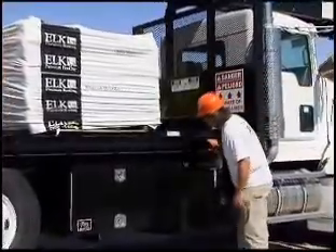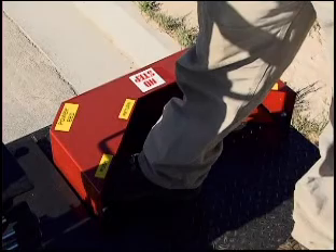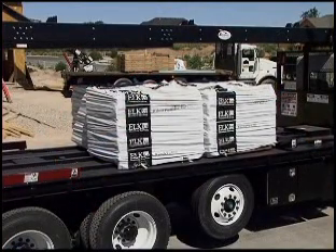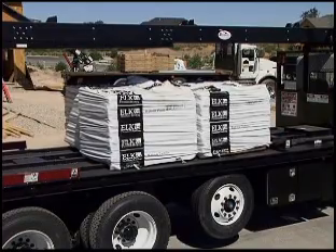Making sure there are no obstructions between the power bar and the pallets, depress the power bed foot controls to move the next set of pallets onto the power lift platform. Use caution when pushing pallets over the power lift platform to avoid pushing the load too far forward.